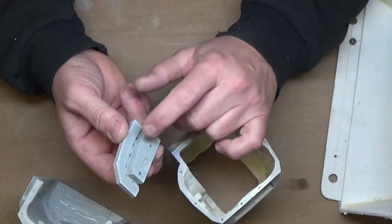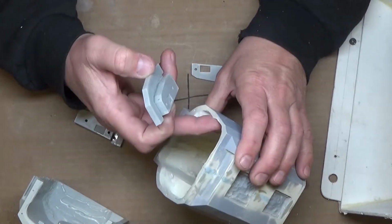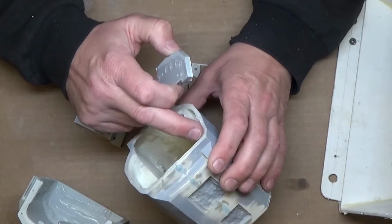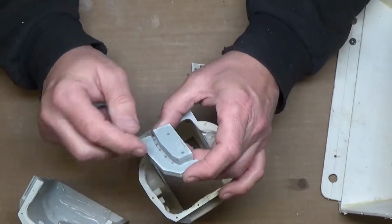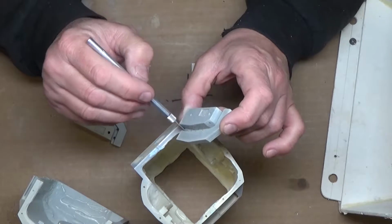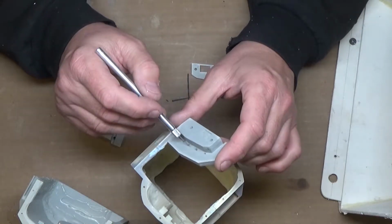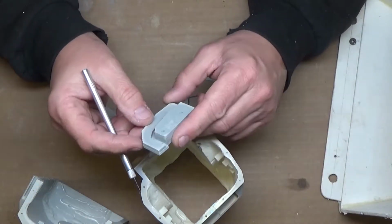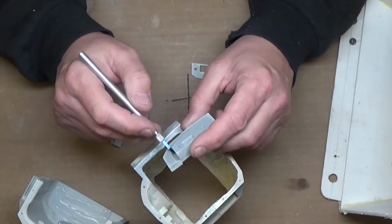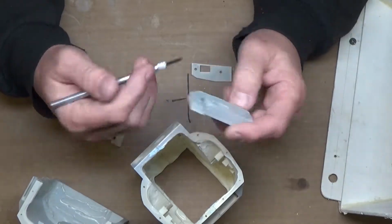In the kits, there are these little guys right here, and these are jigs for molding the interior of this nice and flat so it looks nice. But what has to happen is this has to get ground out to 1/8 of an inch, so this will fit over the edge, because the guide that we're using is this edge right here. These ports right here are to let Bondo in. You're going to have to do this with a polyester or epoxy-based hardening filler, putty, whatever you want to call it. I'm using Bondo because it's readily available, and I don't have any magic sculpt on me, which is a little less fume generating. Anyway, I'm in my shop, so I have ventilation in here, and it's not an issue.